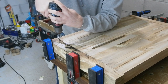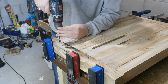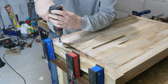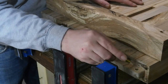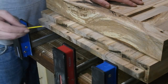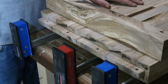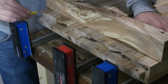The ends are to be doweled in place — four 8 mil dowels each side. I don't want them visible from the top, so I drill from the bottom with a stop set so I go through the tenon and halfway into the meat of the top. Normally you'd have a dowel center that is fixed with the other dowels having an elongated hole in the tenon to allow movement. On something like a dining table this makes sense as movement is at least equal toward each corner. My bench will be up against the wall, so my fixed point will be at each front corner, with elongated holes towards the back.